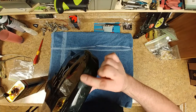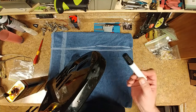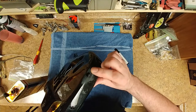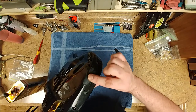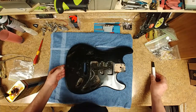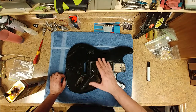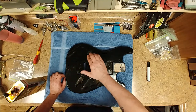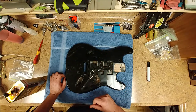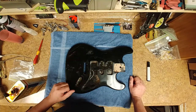There was a really bad chip over here. What I did was scuff it up with some 400 grit sandpaper first, then used a black stain marker to color the wood back black, stained it, and used a little bit of crazy glue - there are two layers of crazy glue on here and I have to level sand that again. So all of these nooks and crannies are basically sealed up for right now. I just need to let this dry, and then I want to remove this adhesive because it's going to cause sticky buildup on the sandpaper.